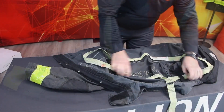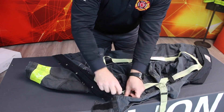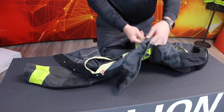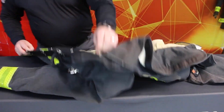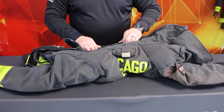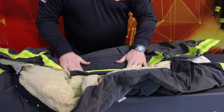If the DRD is fit for duty, reinstall it according to manufacturer's instructions. Make sure all attachments are functional and the webbing has no twists. If the advanced inspection was satisfactory, reassemble the garment and return it to service. If it needs repair or additional testing, send it either to a verified ISP or the manufacturer.